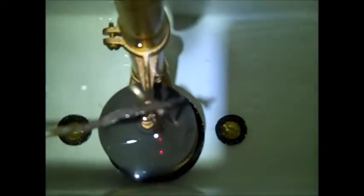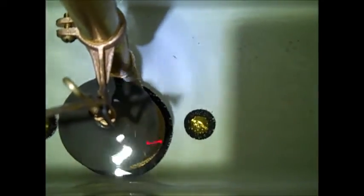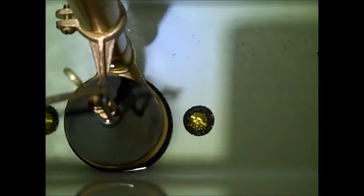So here goes with the flush. The tank has probably about two and a half to three inches of water left in it, so I'll start refilling with gallon jugs. Once the water reaches the water line, I'll turn the water back on, aim the refill tube into the jug, flush the toilet and see how much water comes back to the jug. And this will give us the amount of water that this toilet actually uses.